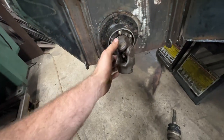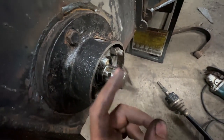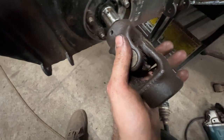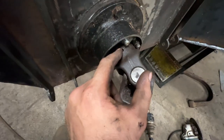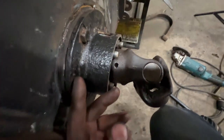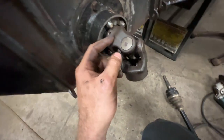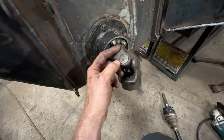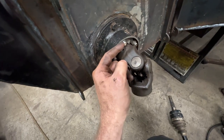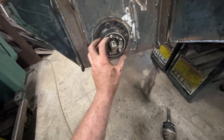As you can see, I came in here and cut this off with the bandsaw, and this is working out exactly like I had planned. I cut these bolts off a little flusher if I really wanted to, but essentially it seals there — my grease nipple's going to be right here. This will now slide in over that perfectly. I can get at my pin and hit that down, but we're going to cut these ears off and make a flange — the flange is going to be pretty much dead on right here. I need to make sure I leave enough room; I may have to get some type of carriage bolt or round head bolts so I don't protrude out. The seal is backwards — I'm waiting on new seals — but I just put this in for fiddle and clearance purposes.